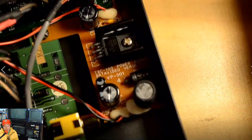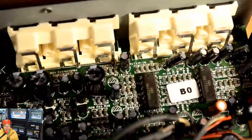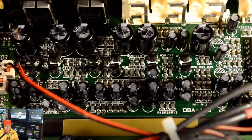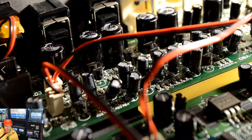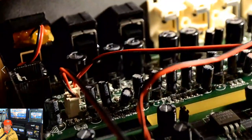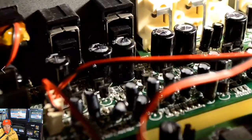Here's a look inside the unit. I didn't test it again because I knew it wasn't working — we're just going to look inside and see if we can find anything bad. Immediately after inspection, I noticed a lot of the capacitors had expanded extremely, especially the large ones I've marked with a Sharpie. That's a sign those caps have most likely failed and definitely need to be changed. Thankfully none of them blew out, because there were a lot of surface-mount semiconductors and resistors on the board that I'd hate to have damaged by electrolytic fluid.